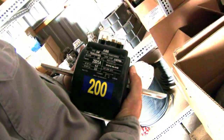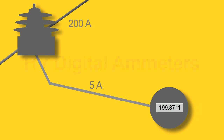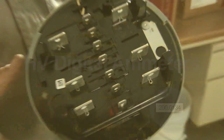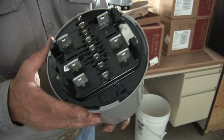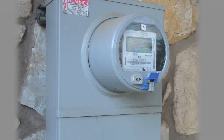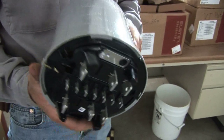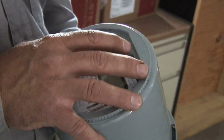This is the secondary side. You can measure 800 to 1,000 amps with this meter using those CTs, because all it's ever going to see is the ratio of the CT you put on — so it'll be 5 to 10 amps going through this metering.